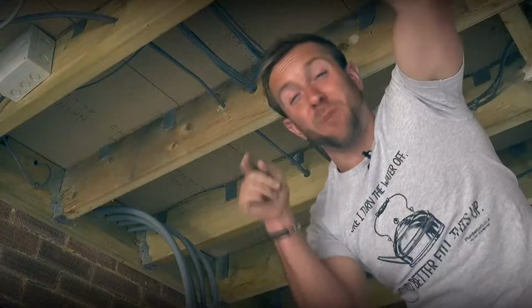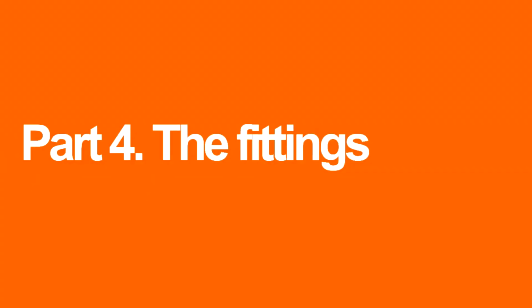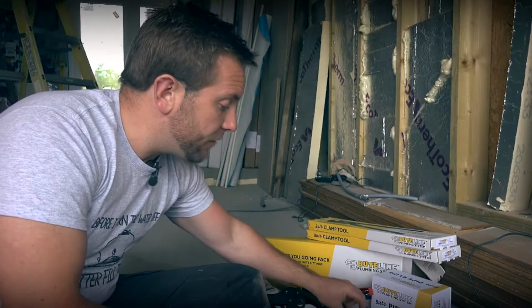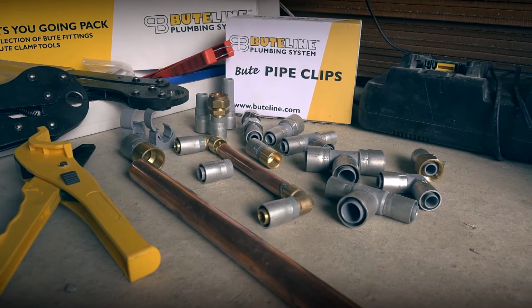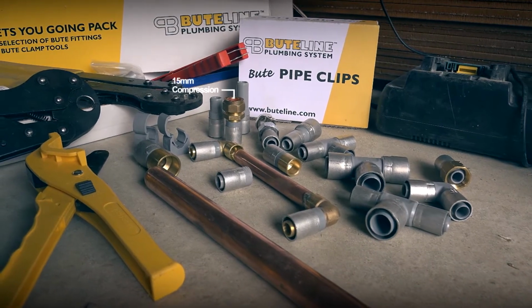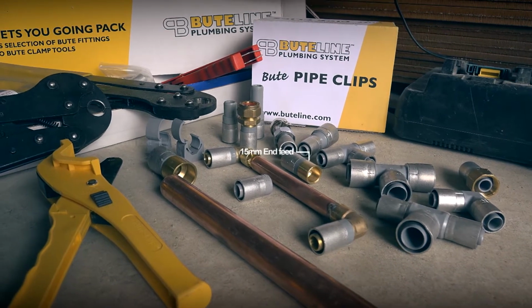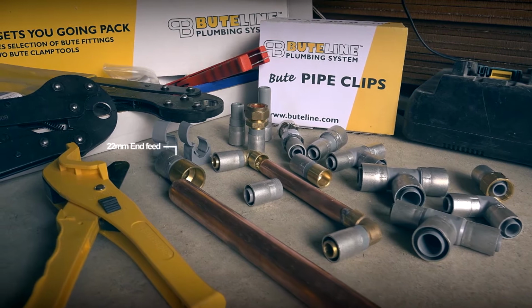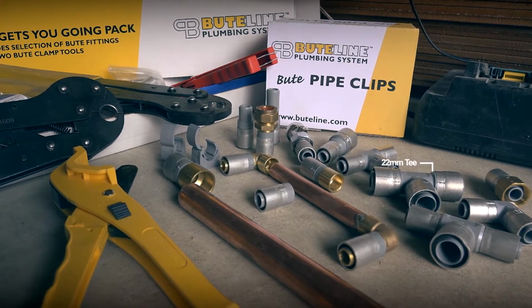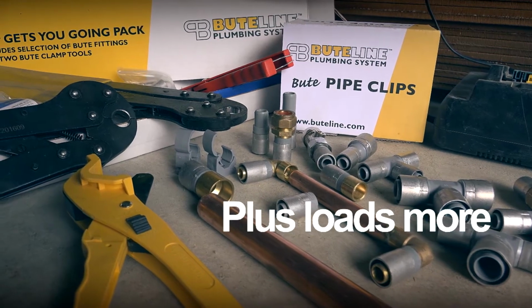I've had it happen. Let's pop down, get cross-legged, and just sit down and have a look at the fittings themselves. As you can see, for a start, there's loads of different types of fitting for this stuff. You can convert it over easily to 15mm compression. There's all types of different iron fittings, soldered fittings. Obviously, when you do a solder fitting, just take off the plastic collar and the aluminium collar before you do any work like that. And then you just solder that on itself, wait for it to cool down, and then boom, you're easily converting over to plastic then.